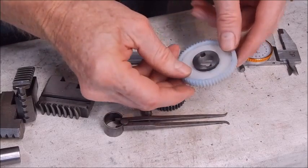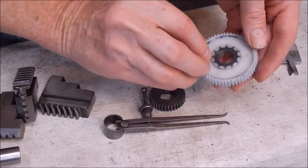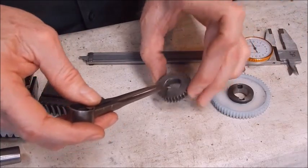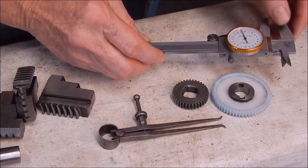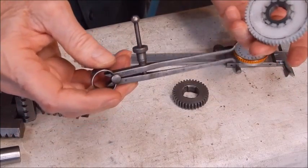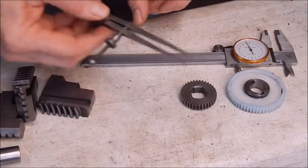We've machined out the center of our gear with a little carbide boring bar. I stopped every so often, took the gear out and put it in a bucket of water to cool it down a bit, and it didn't melt or fall apart — so far so good. I checked the center dimensions with a set of internal dividers. I think you get a better result that way than trying to do it with calipers — you can get a nice frictional feel and know exactly how close you are.